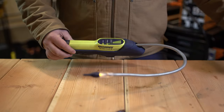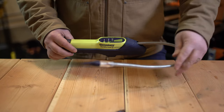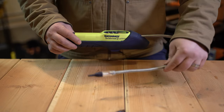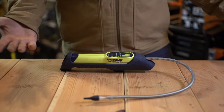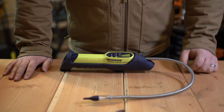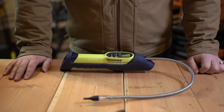If you're up on a rooftop looking at a piece of equipment, I've had a gust of wind go by and it starts pointing you in the wrong direction, making you think you're getting a leak. Right now I don't even know what it's going off of — there's no refrigerant even in this room. So like I said, this thing has been really unreliable for refrigerants, but it's been all right for combustion gases.